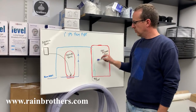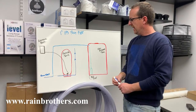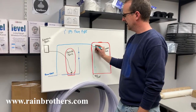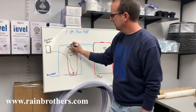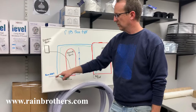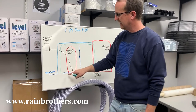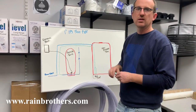Next you're going to install the new pump — the Springer Series traditional pump — inside the well reservoir tank. You're going to run this water line out of the top of the pump, out of the tank, again using our one inch tank penetration gasket, and run this water line right into the tank tee as if it were the old well line. We're just basically interrupting this water line and making a circuit — running it into the water tank and then from the water tank back into your existing tank tee. On the plumbing side of things, that's all there is to it.